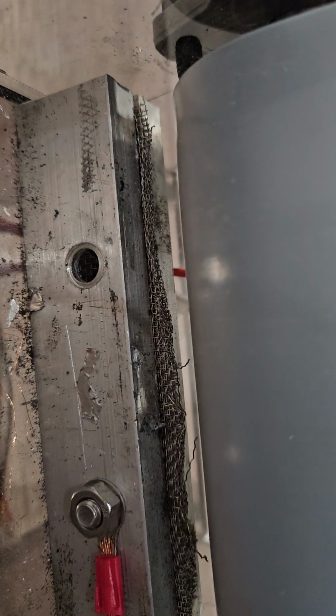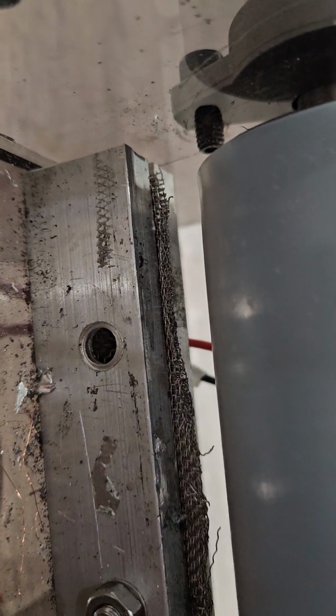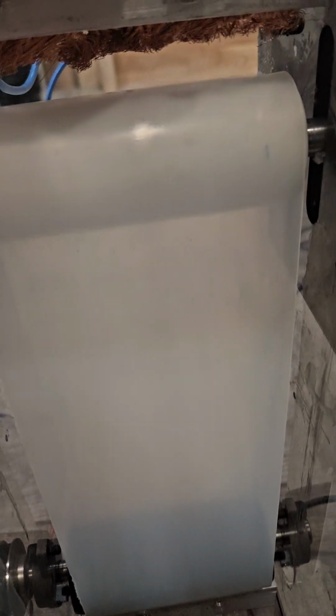those positive charges attract electrons inside this brush down here, and so it becomes positive as well. And so by extension, that means that this bolt and the interior of the capacitor becomes positive. And of course the opposite happens for this Teflon roller up here, which likes to become negative. However, there are several problems, well, one problem specifically, but several reasons to explain it.